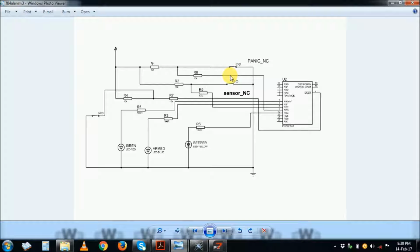So you have two inputs. Well, I would say two loops, not one, of course, but the other one is normally just provision for panic. It's not really a loop for sensors. It's actually a switch that you activate. Press in, it sounds, although sometimes you can use it as a sensor on a critical door. If you just open it, the alarm goes on. So what does it have? Those two inputs, the security key switch here, and then the outputs.